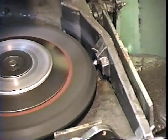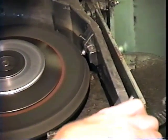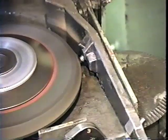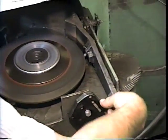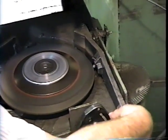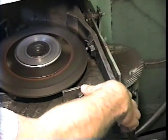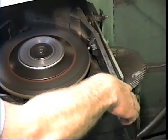There — that was a little light. I'm going to do it a little louder so you can actually hear it. There, you heard it. I went up and down. I made sure that the wheel is dressed. Now I'm going to back that stone up on my hand wheel about two degrees, which will give me maybe about two thousandths dress. I'm going to put my thumb on the top of the cam holding the arm firmly but not real powerful — just firmly. And I'm going to bring it up as slow and as smooth as I possibly can.